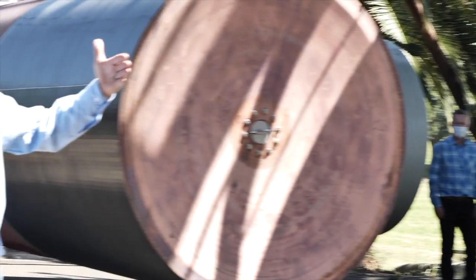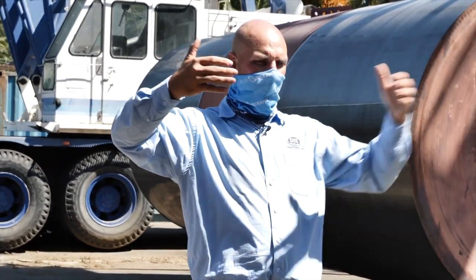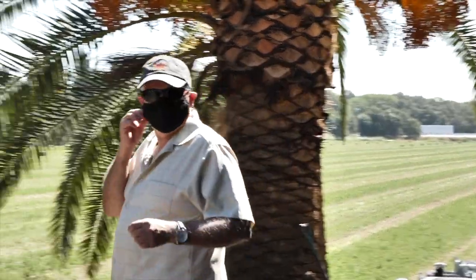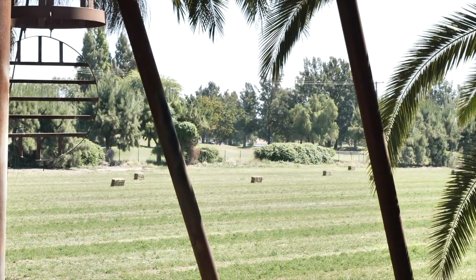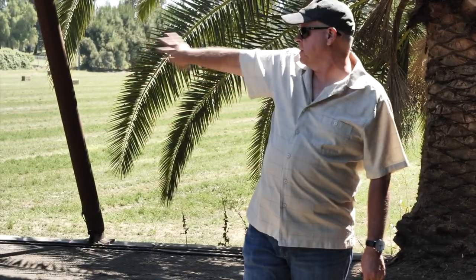So Phil, there is a gate behind each screen? Yeah, there's actually three gates behind you, but one right behind the screen. And is that what you're going to use, so you're going to have a gate and a flow meter? Or we're probably going to use the furthest downstream gate to modulate. We got all these gates for a variety of reasons. We have to be able to isolate the facility for flood protection and for maintenance. So that's what the main gate right behind the screen's for, is just to be able to isolate the piping.